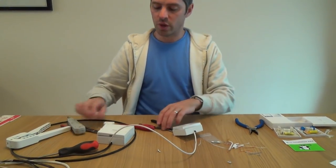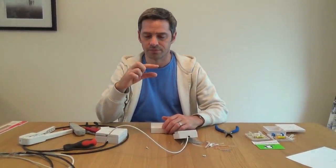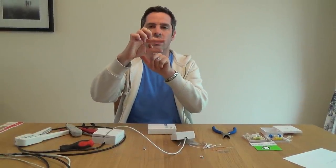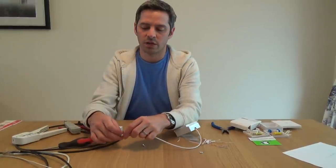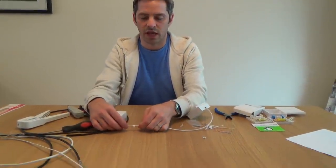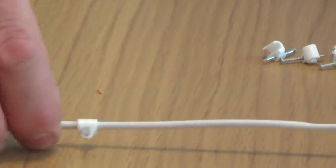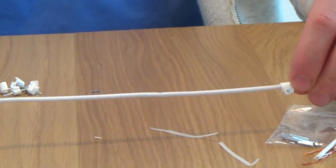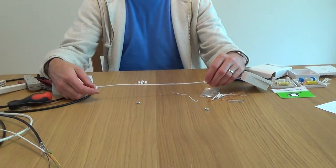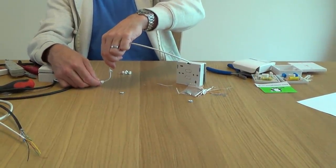When you're running the cable, there are two ways of doing it. The neatest way is to use a staple gun with little round cable tacker staples - not upholstery staples. They're often white so they blend in nicely. But if you don't want to buy a staple gun for one job, get yourself some little cable clips and always put the nail underneath the cable clip. When running along the skirting board or around the architrave, always put the nail to support the wire underneath. Do them about every foot or so to make a nice neat job. When you go around corners, put the cable clips closer together.